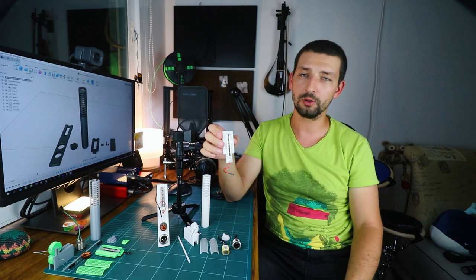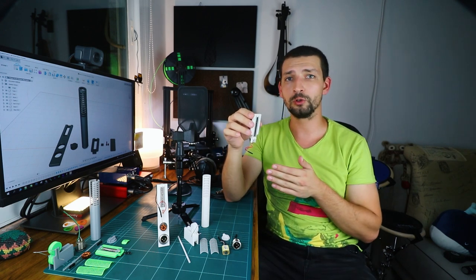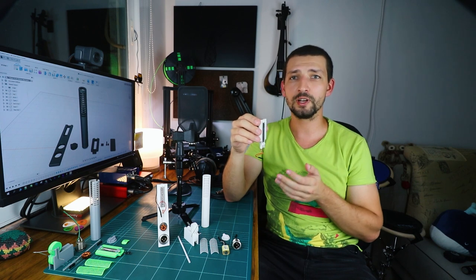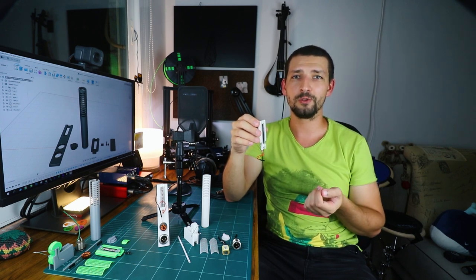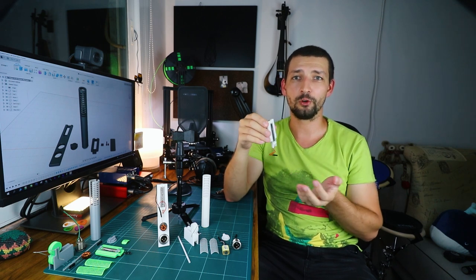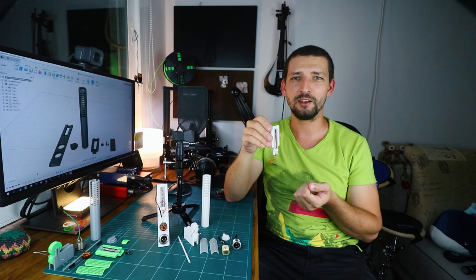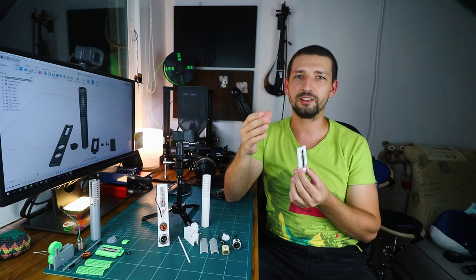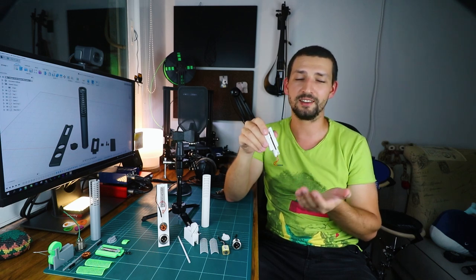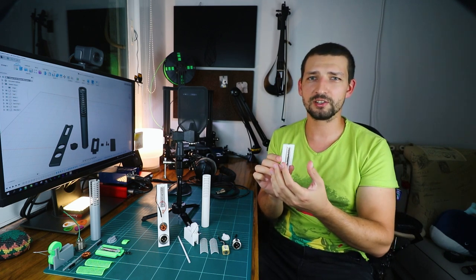This prototype is about a year old now, nothing warped, the neodymium magnets were glued with a regular super glue and seem to hold well, although these specific magnets are thinner than Royer seems to have and are only grade N42 neodymium. The Royer is using grade N52, but K&J Magnetics didn't have such strong magnets at that time. The thin aluminum ribbon is 2.5 microns thick, just like a Royer, as far as I know.